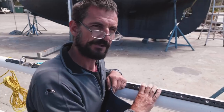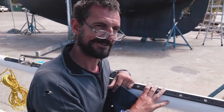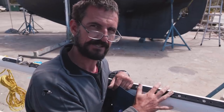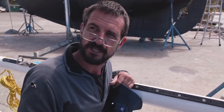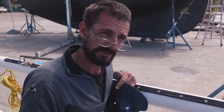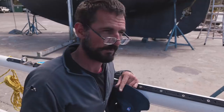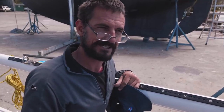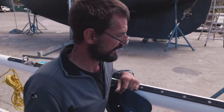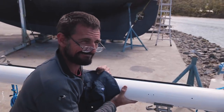So now everything that's on this mast, there's no different fittings. All riggers still use Imperial. We've got quarter inch and 3/16 UNC fasteners on the mast. And then on the deck, I'm just going to have metric 6mm, 8mm and 10mm. I think there'll be a few 14mm bolts, but everything should be pretty standardized. And what that'll mean is the spares kits of fasteners and taps that we need will be much, much, much simpler.